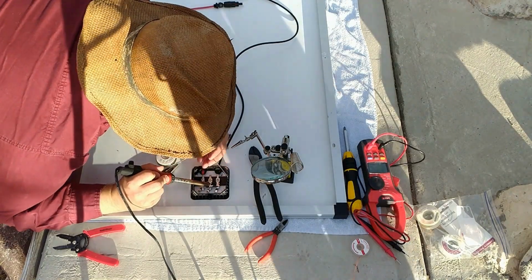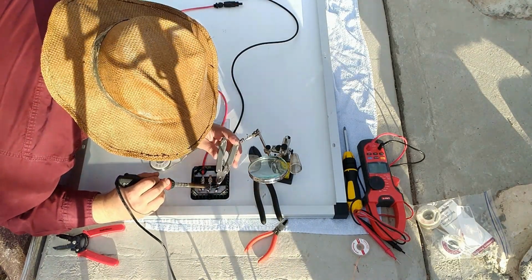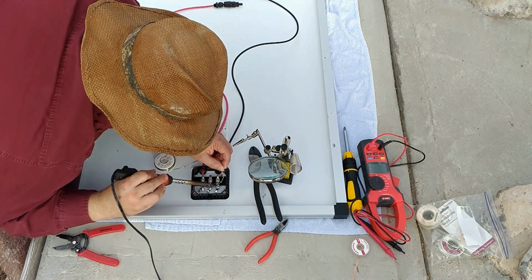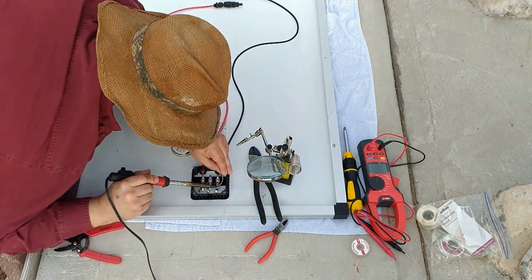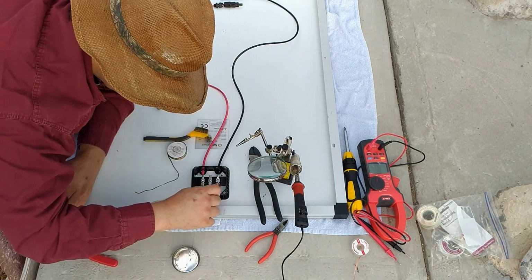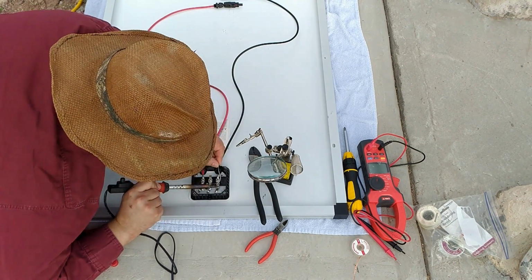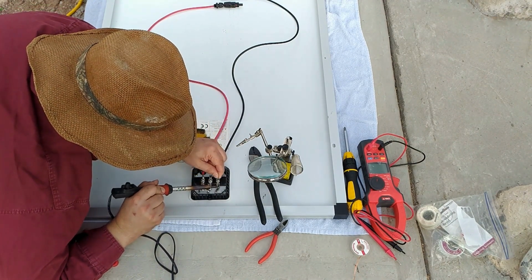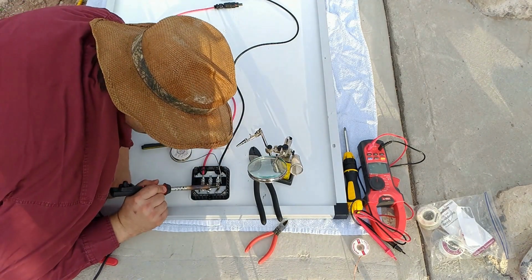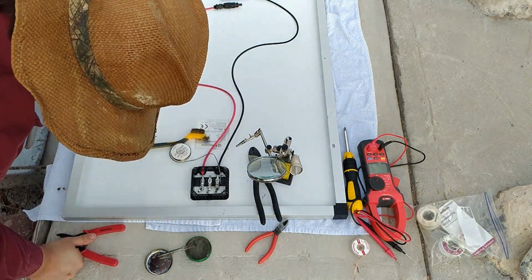Now, as you might imagine, I ran into the exact same problem. My solder and the Chinesium solder were not getting along. I was not winning on this. So I worked on it, tried, worked on it, and I decided, oh, you know what? I'm probably going to need some flux. Why I didn't do this sooner, I don't know. But I got the flux, and then the solder started bonding correctly. Wonderful. Got my first joint exactly what I wanted. So I spent a little work on it to make certain it was exactly the way I wanted, and went over all the others real quick.